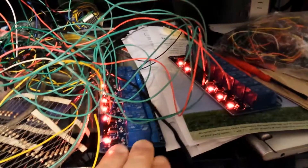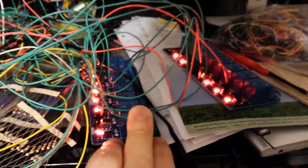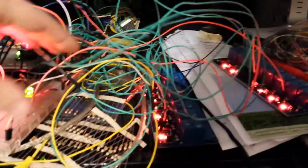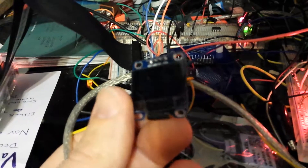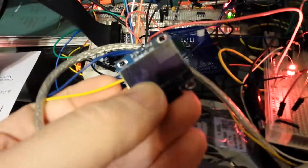These are going to control my Christmas lights show. I really like these boards — they're so cheap and not complicated to use at all, especially with two little shift registers. I'm only using three GPIO pins on the cobbler, which leaves plenty of room for a nice OLED display showing what music is playing and what light show is playing. I just need to add some buttons and maybe come up with a case.